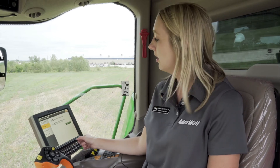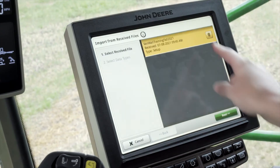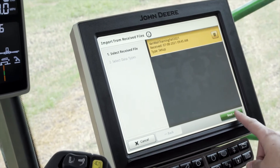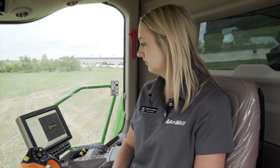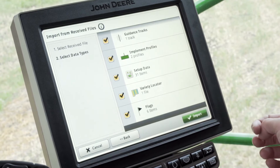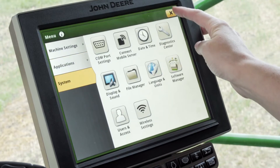I have sent a setup file to this display using Operation Center. Notice right here it says 'Import from received files' — that file has not been imported yet. We'll click on that, click Next, and here is the file I sent. Push Next and it's going to load all of that data included in the setup file. Once we verify everything in the list is correct, click Import. It will bring up an import complete box when successful. Push OK and close out of the File Manager and the menu.